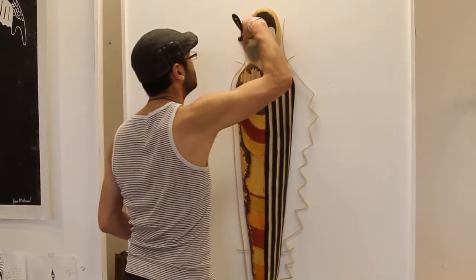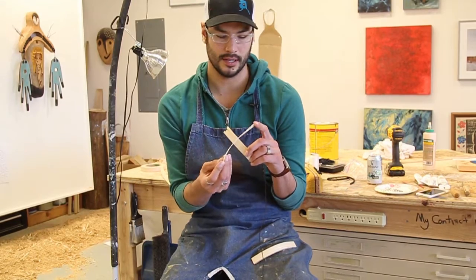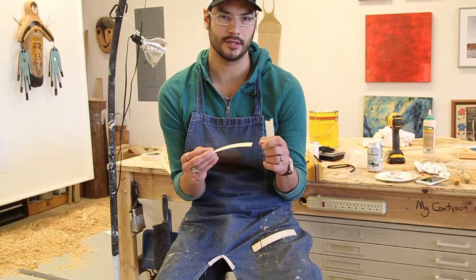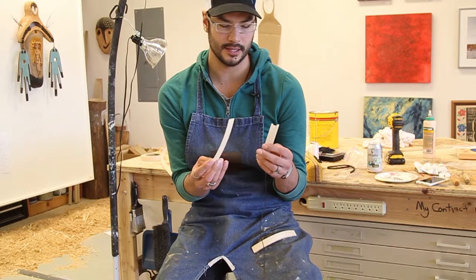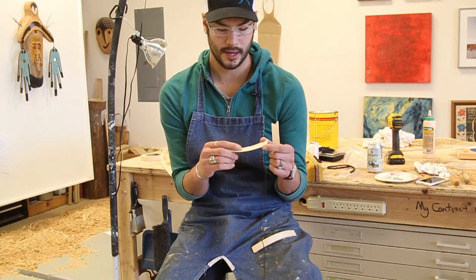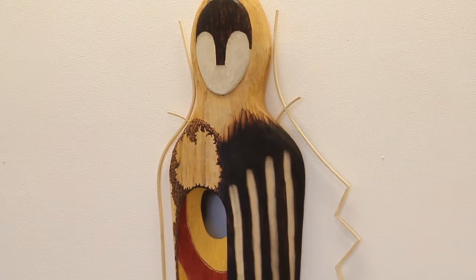When I was walking around in a specialty wood shop, I found this stuff called veneer, which is really flexible. It's a really thin layer of wood that you put on cheap plywood, and they use it for furniture and stuff. What's kind of cool about this is it comes in rolls and it has a glue on the back, and this is used for edging. What's interesting about this glue is it's heat set, so you don't have to apply it wet or anything. It's already on here.